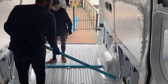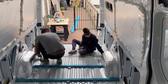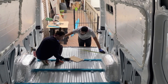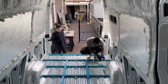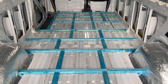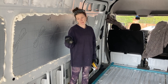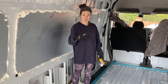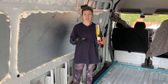The blue wood we're using is pressure treated to make it more resistant to water, so on the off chance any water gets under the floor it shouldn't rot the battens — just an extra precaution against water damage. We measured and cut each cross batten individually, placed them into position, then repeated the process for the lengthways ones. We labelled up all the battens, marked out on the floor where they go, swept and vacuumed everything, and now we're going to bring them back in and stick them down with Tiger Seal, an adhesive sealant that's supposed to be really strong.